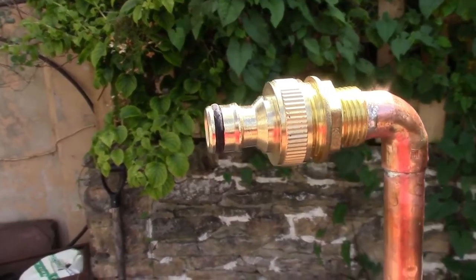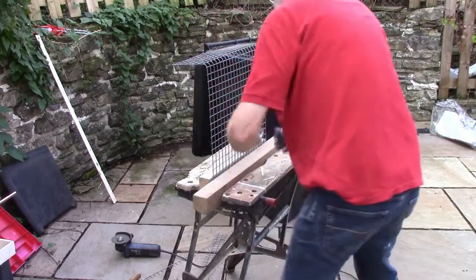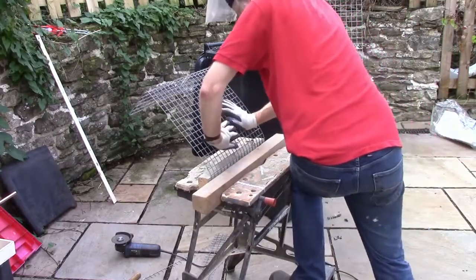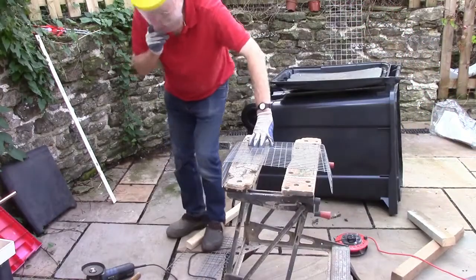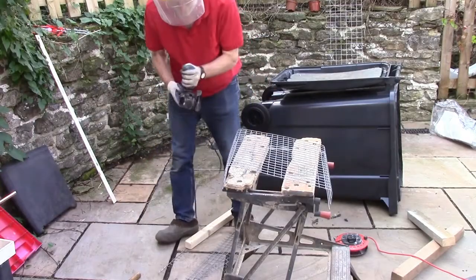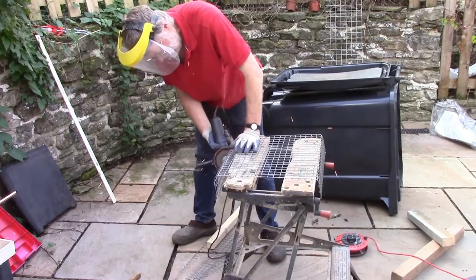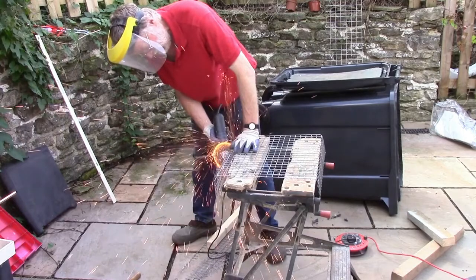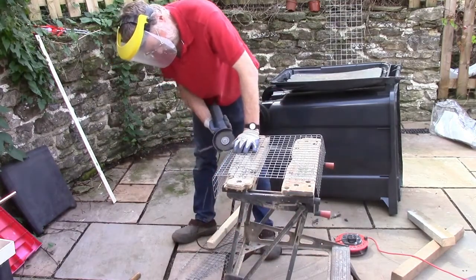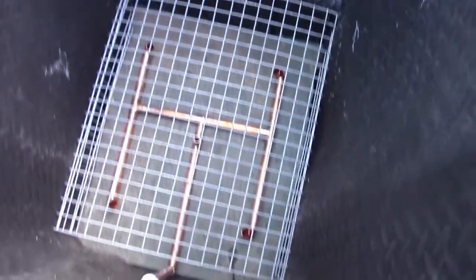This is the top fitting. Now I'm going to put a cover in, made out of mesh, over the steam distributor. I'm not sure whether you really need that, but it seemed right for me. That's just an odd bit of mesh I had, and I'm just trimming it to size with an angle grinder. Shouldn't really use them with just one hand, but if you're familiar with them and you're only cutting a light section it's okay - eye protection is a good idea. I'm wearing gloves all the time. There's the cover in place - it's just pushed in, it can come out if you do need to clean the thing subsequently.